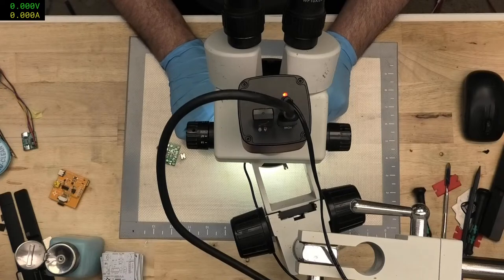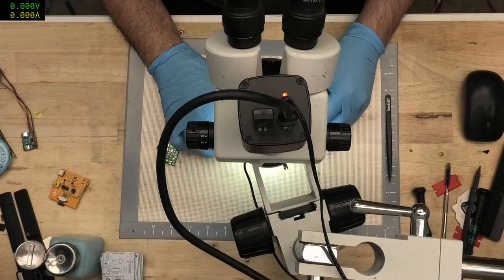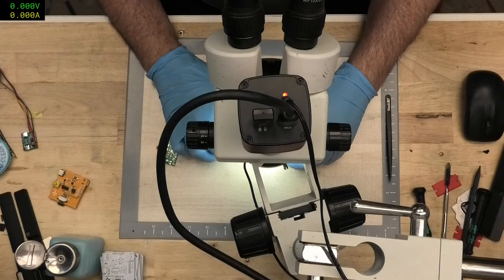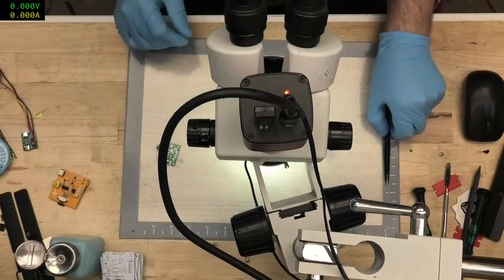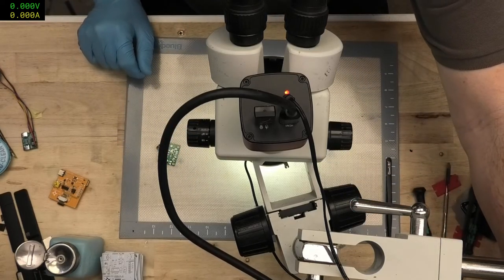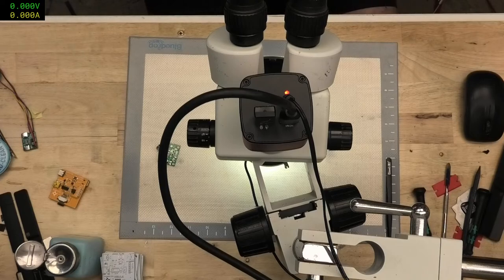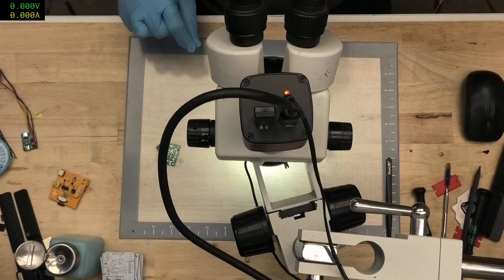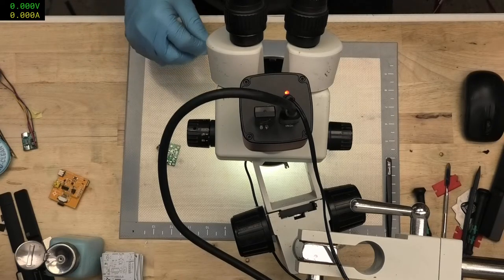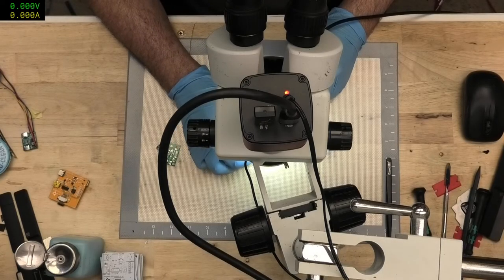Anyway, we'll get to the point of what this is for, and we're going to solder in these ones. The other boards, the ones that I've got coming in, which are the dual, they're still the INA-219s, but they will be supporting both the formats as opposed to just the one or the other. So I'll be able to do either SO8 or SOT23. Okay, can we just tack this down, please?